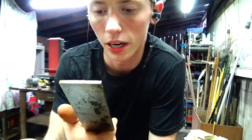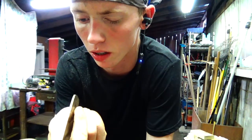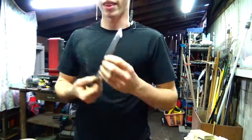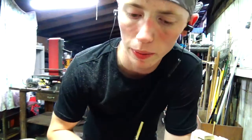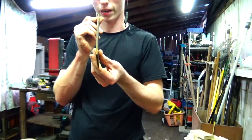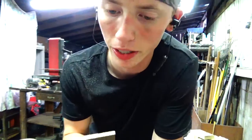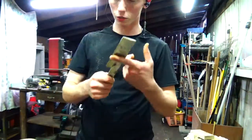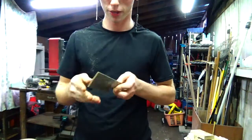I don't have enough material to grind out that little bit of forge scale, and I still need to make this somewhat straight. I have a warp in this one as well that I cannot grind out unless I put it on a big grinder magnet, but I don't have one of those yet. I'm thinking of using a piece of angle iron as a flat reference, or maybe I just have to heat it back up and flatten it back out with a wood mallet. I love that texture though.